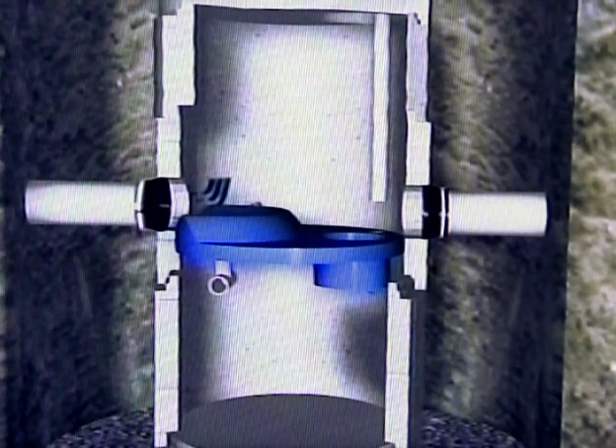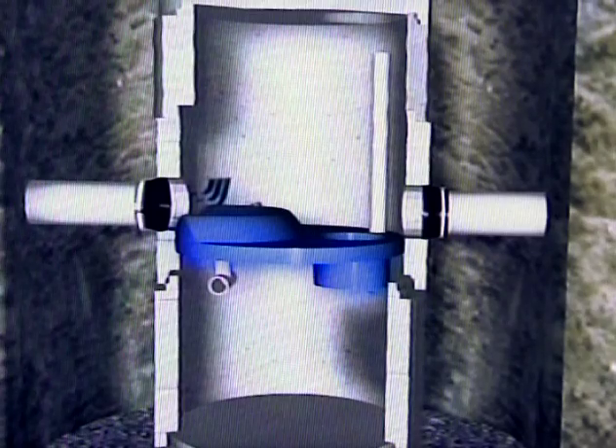Next to the 24-inch uppipe is a hole for insertion of a 6-inch PVC vent pipe. Attach with PVC adhesive and extend this pipe upward to approximately 18 inches from the top cover slab. For models 2400 and larger, an extension piece must be inserted into the existing 24-inch opening from the top side of the fiberglass insert and sealed with polyurethane caulking.